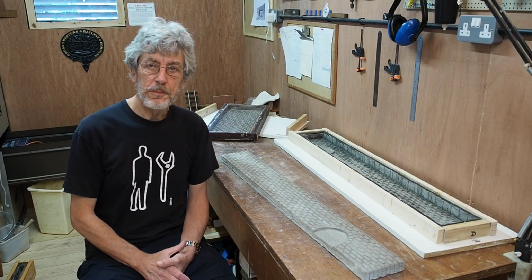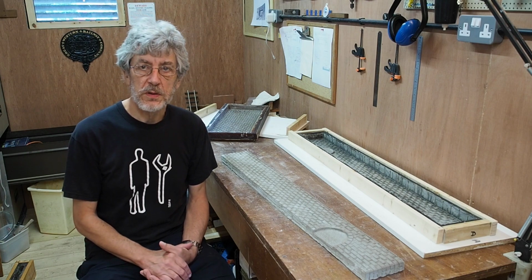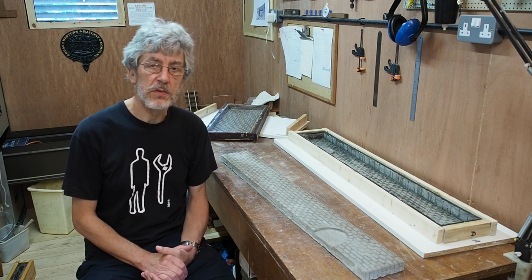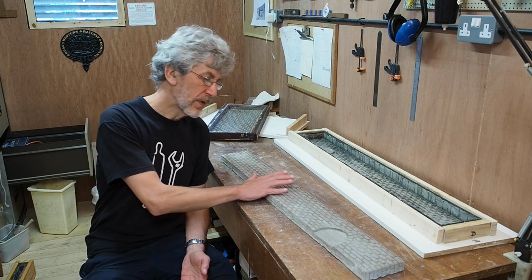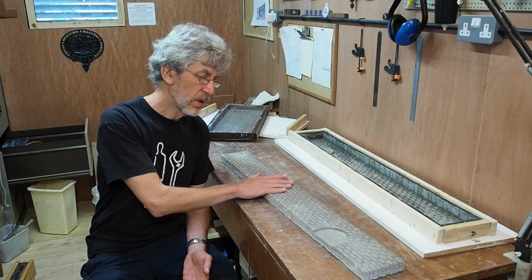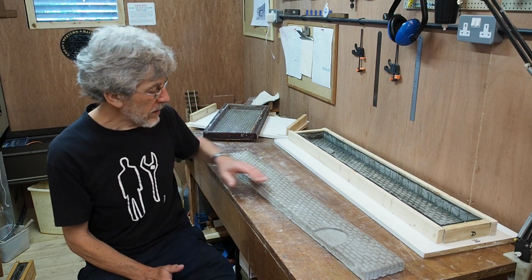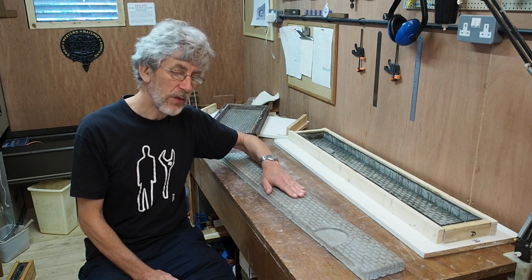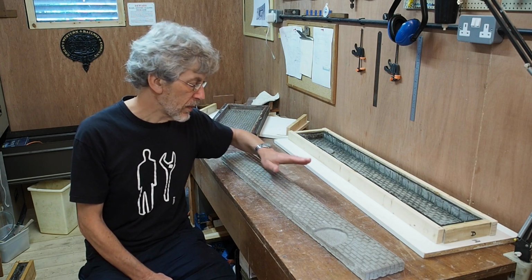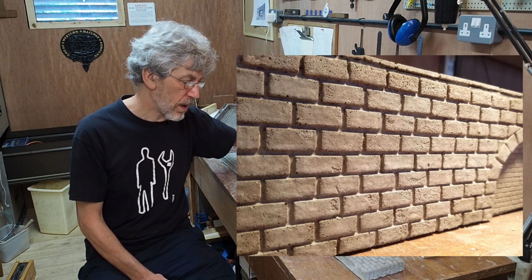Hi, it's me again. I just thought as I was wrapping up the second video that I would tack on the end a few notes and reflections over the process, especially having now cast a second section of walling out of this new mould. The second one, the concrete mix was a bit wetter, in fact a little over wet in this case, and it's much smoother.